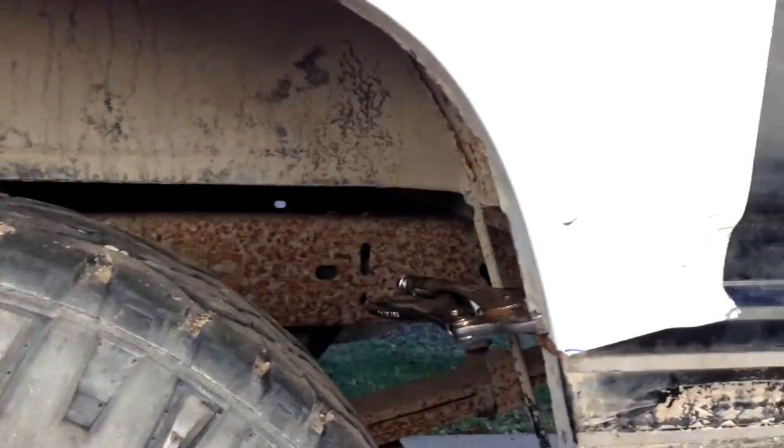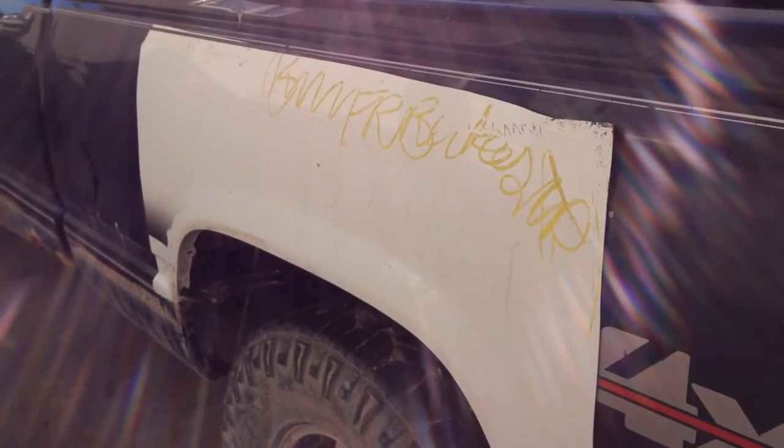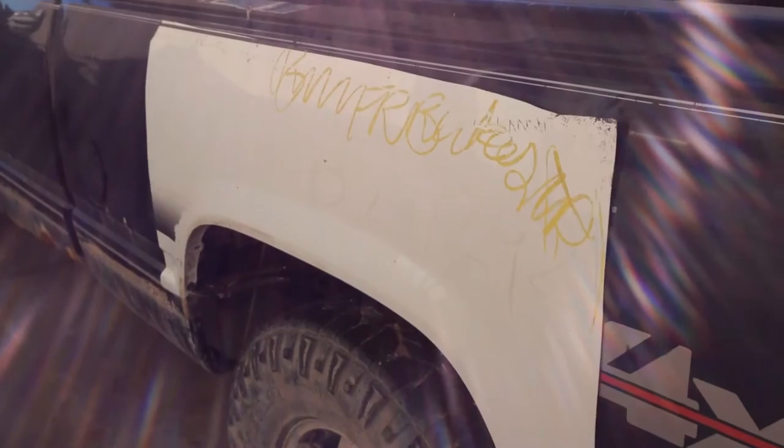Alright, we're back. It's a little windy so the sound might suck. Put some vise grips just on the bottom of it there to hold it in place. When I go to weld it, I might put some self-tappers on the top. Before I weld it though, I got it ground down to bare steel so it'll weld nice and all that jazz. Here we go.